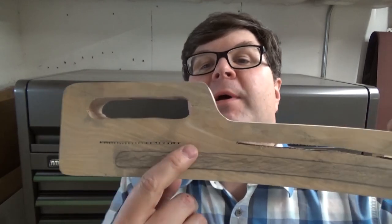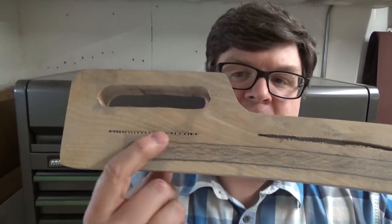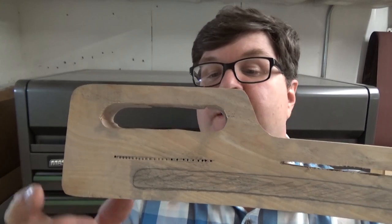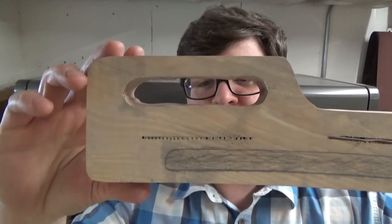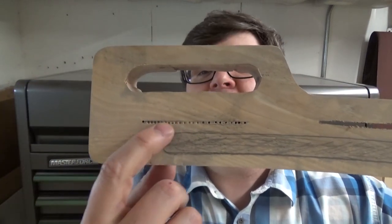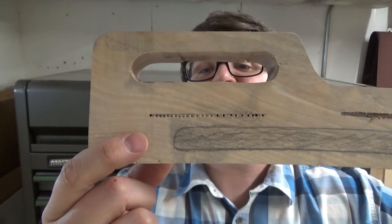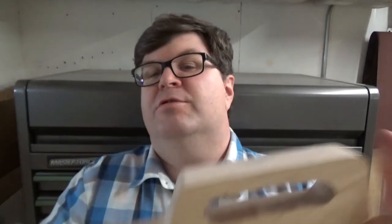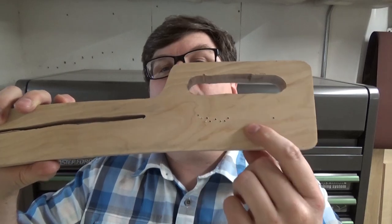Then I thought I would come in and use my center punch to punch a line of holes along the line for this slot and then just drill them with a really fine drill bit. But that was a rookie mistake because even though this line looks perfectly straight and beautiful, look at that — the drill bit was just too thin. It would not stay on track through this hardwood. It followed the grain and wandered off wherever it wanted to, and I knew that would happen. Why did I do that? I'm losing focus on this project.